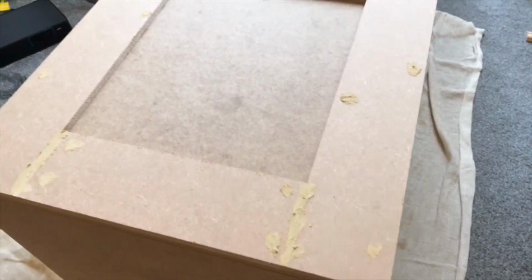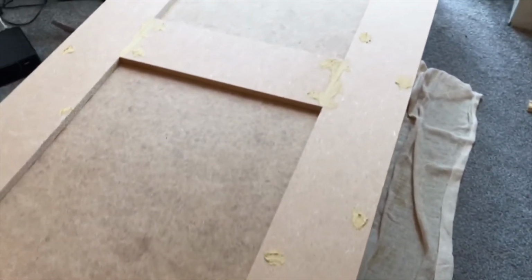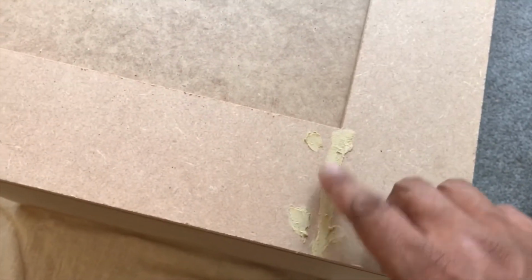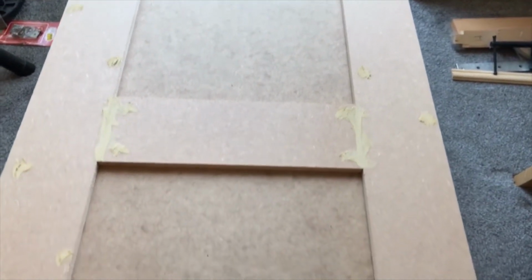Right, guys, so you've just seen the tops being oiled and how we figured out the hinges and stuff. It's done. We just now need to think about finishing. So it's paint grade. We're going to paint them, and just to make sure we get the best finish possible, we've gone round and filled in the brad nail holes as well as the joins between the two panel boards. Slight gaps, a little bit of filler, sand it back, bit of paint, you're never going to know. So yeah, nearly there. So sand this back and get ready for, well, primer, undercoat, and then top coat.